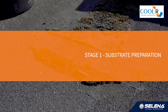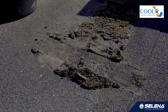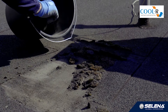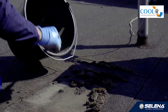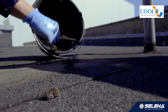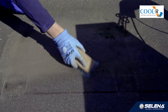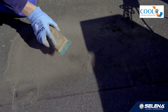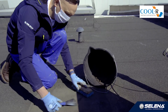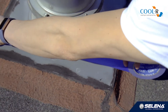Stage 1: Substrate Preparation. Substrate preparation is the first step of resin application and the most crucial task in the process, especially in relation to liquid materials. The substrate should be cleaned thoroughly and washed if needed. Only clean water can be used on roofing paper, whereas application on steel requires active foam to dissolve residue dirt. After the substrate is cleaned and before priming, masking tape should be applied in resin cutting areas.